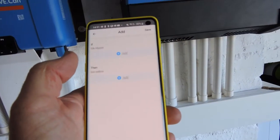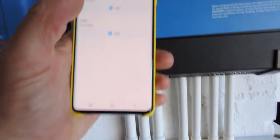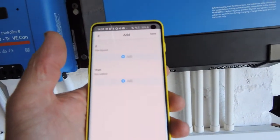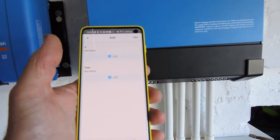That gives you the flexibility. I do recommend that you allow 60 seconds before turning it back on, because it takes 60 seconds for the inverter to sync back to the grid and it will stop you putting unnecessary load on the battery.